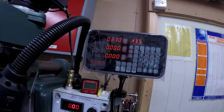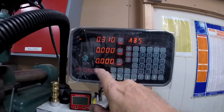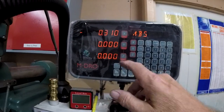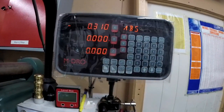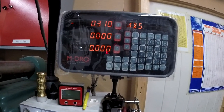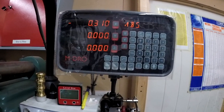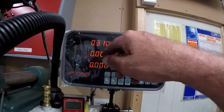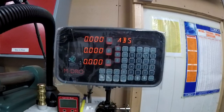Not shown this much. This is the DRO that we'll be using. My Z, I've just scratched off onto the face of the work on the Z, which is up, and then we'll dial in how much we're going to cut at a time. It'll only be very, very small increments, probably a quarter of a mil to start with, maybe go up to half, but I don't take big chops at a time. X is irrelevant really, I'm just zeroing that mark, it doesn't mean anything.